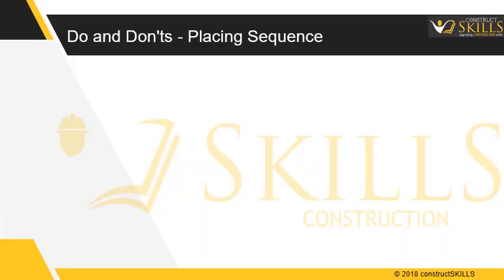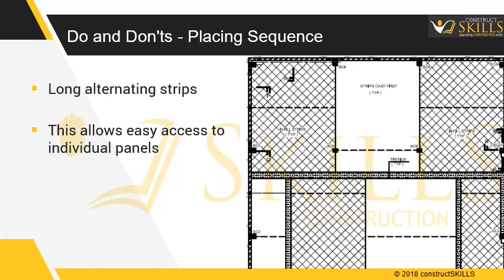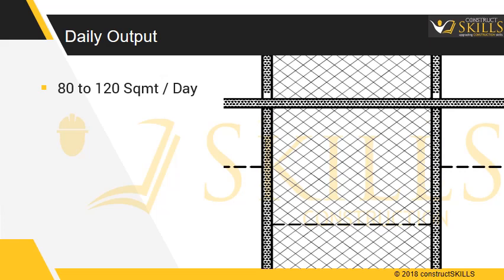Placing sequence. In most cases, the efficient way to place concrete in large areas is in long alternating strips, called panels. Reinforcement needs to be tied for each panel. A checkerboard sequence of placement is commonly used, which permits concrete shrinkage of cast panels before adjoining pavements are cast. Roughly 80 to 120 square meter of area can be covered in a day by a concrete mason by using a walk-behind floater and a trowel. Assuming a width of panel to be 4 meters, a 30-meter long panel is usually cast.